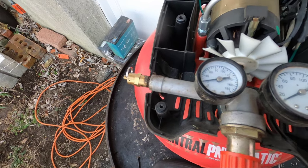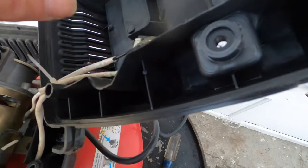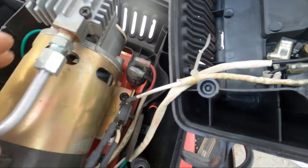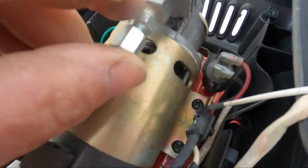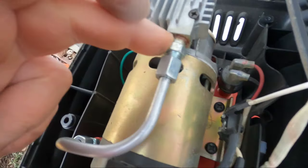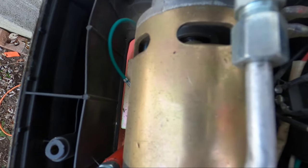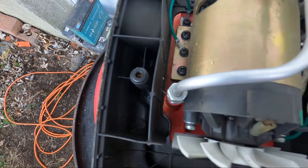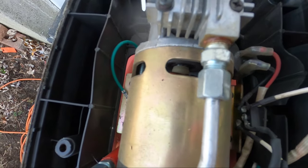Okay, so now we've got it off. I notice over here I thought maybe this line somehow may have cracked. But see this rust? In this compressor it does build up moisture. I'm wondering why it's rusty over here and nowhere else. I'm wondering if it's blowing past this. I'm going to put a wrench on here and see if I can snug this a little bit before I take it all apart. That looks like the only other place it could be leaking in here, maybe down in here at these joints.